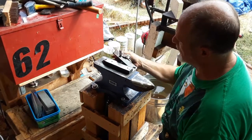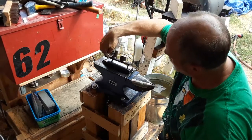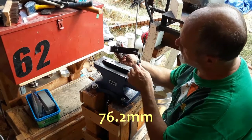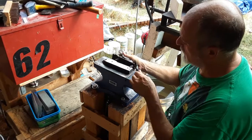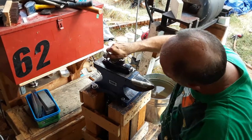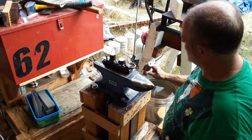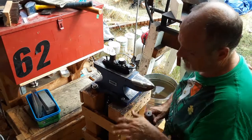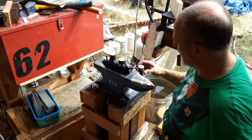The pegs down here are three inches across, center on center. These are quarter inch material, but the holes are 1/64th larger than a quarter of an inch so that it slides down easily. I'm looking forward to using this monkey tool at some point — it's also 1/64th larger than a quarter of an inch. So I could take quarter inch stock in there and shoulder it up, or even rivet head it if I want to, but this is meant for shoulders — meant for round tenons.